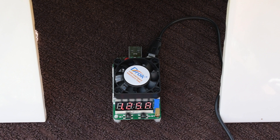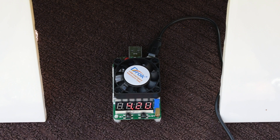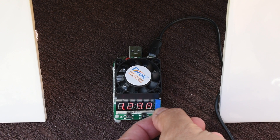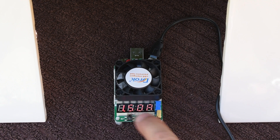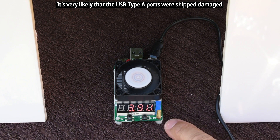It's set for one and a quarter amps to start. The open circuit voltage is 5.2. The panel has been sitting in the sun for about 15 minutes. Let's push start and see what's happening at 1.25 amps — 5.2 watts at 4.2 volts. That's a pretty big drop for only one and a quarter amps, not looking too good. Let's increase to 1.5 amps. Lux reading is 80,300. Now 5.8 watts at 3.9 volts — that is dropping way too low to be charging things. This is not a good sign.